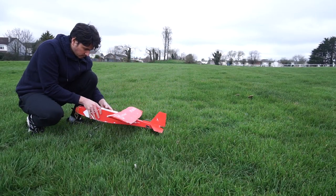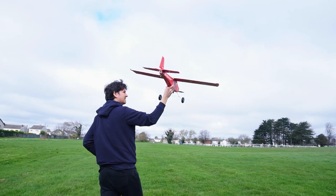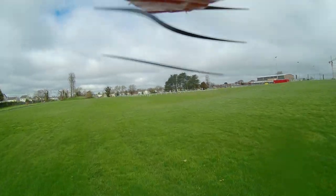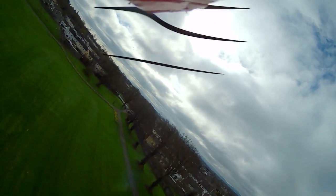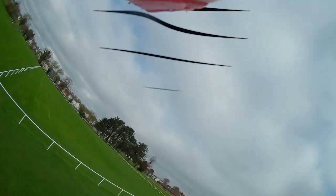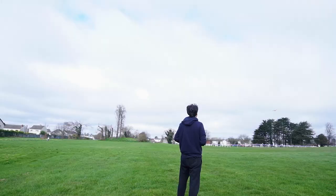This is the first time I'm using a flight controller in any of my airplanes with iNav — previously I've only used flight controllers for multi-rotor drones and always preferred to fly fixed wing manually. On the first launch I used the default mode and when I started making my first turn it felt a little weird because I needed a lot of rudder. Looking at the onboard camera footage, the airplane is pointing towards the outside of the turn, which is very inefficient. I realized that with stabilized modes I need to use more rudder. The flight controller is keeping the airplane level according to my radio commands, so I switched to manual mode to have total control.